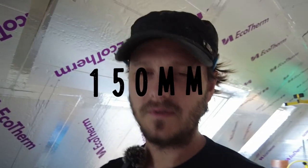How many screws do you put in a bloody sheet of plasterboard? Yes, it's plasterboard, it's not drywall, is it? I've searched the internet on your behalf. You generally get answers anywhere from 150 mm centers up to 400 mm centers. So I tend to take the average of all that information.